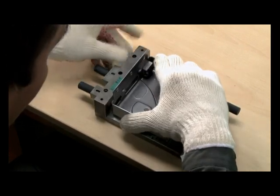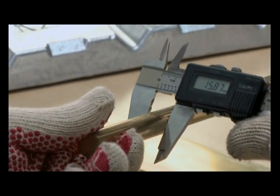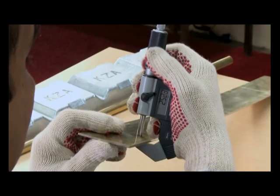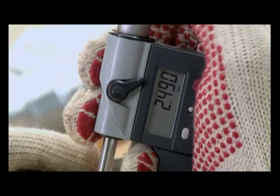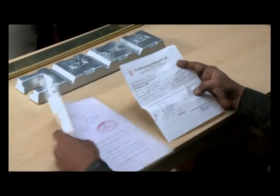The body is checked with a gauge, the brass extrusion is tested with a digital vernier caliper, the thickness of the nickel silver strip is checked with a digital micrometer, and the mazac ingots' quality certificates are verified.